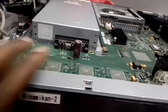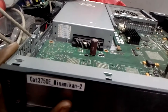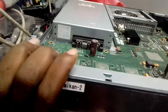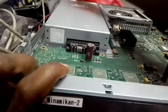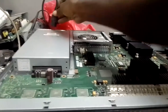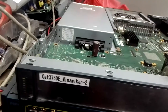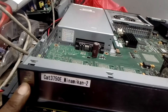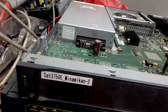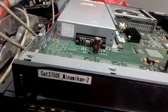This switch has a problem - it has a frozen boot issue. As you know, it doesn't enter console, or sometimes it will hang on the way. I want to plug the power - you can see it's blinking right now, and in a small time it will freeze like this. If you leave it till the next day, it's not going to move from here.